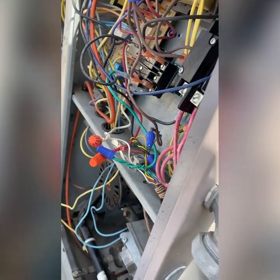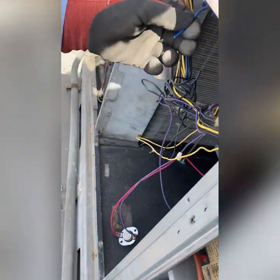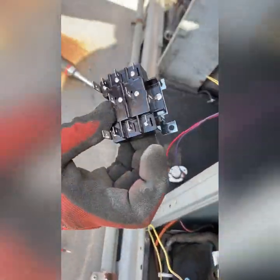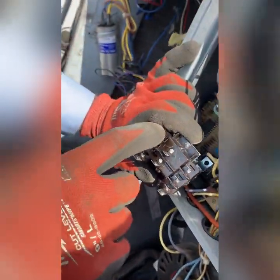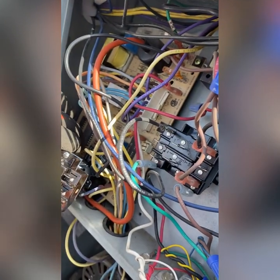So listen carefully. You're going to put a blue wire nut here and you're going to run a piece of wire through here, and you're going to put it on number three. Okay, this blue goes right here. This is number one. You're going to put a piggyback on number one and run a black wire over into this.